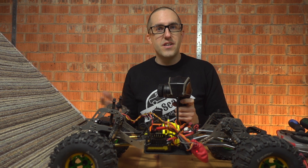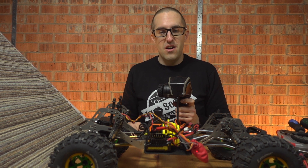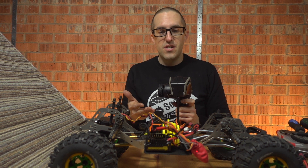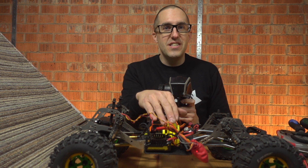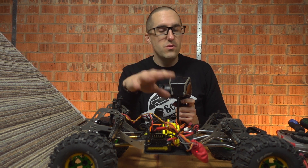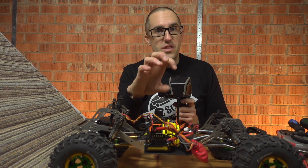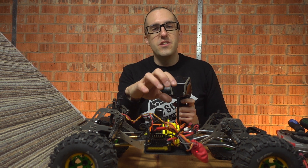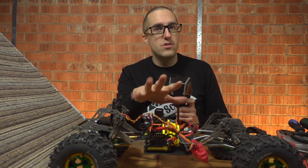Now I have no design background. I have used CAD in the past, but only for personal projects. I designed some gears first, then designed a skid, then took a load of weight out. This gearbox weighs, with all the bearings and the axles and everything in it, 60 grams with an integrated skid. The TRX gearbox and skid weighs about 200 to 250 grams.